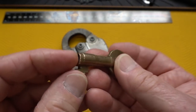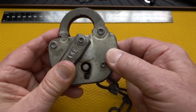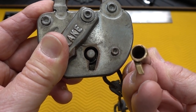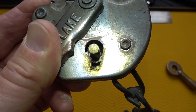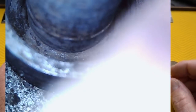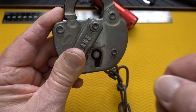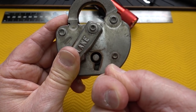On the key — kind of a weird key — there is a central shaft here, and we've got a little cut right there. When we look inside, the keyway is kind of odd. It's shaped like the numeral nine, with a little hole right in the middle for that central shaft. I'll take the lock cam and stick it down in there — you might be able to see there's a steel ring around that shaft. There's a cut in the key to prevent you from taking a wire, shoving it against the back wall, and then tensioning the lock. It's kind of an anti-picking thing.